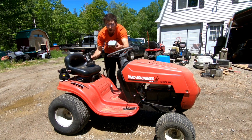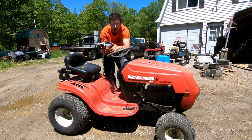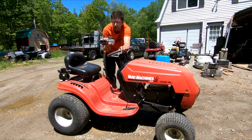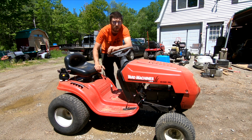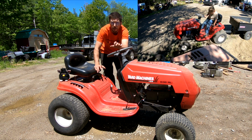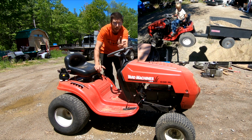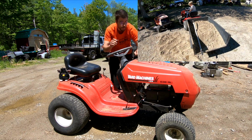And that winch motor we ran off of a regular little 24-volt controller. And I'll include in the description a link for the original video building that. And that worked out pretty good. That setup actually was capable of about 30 minutes worth of drive time. Took about 2 hours to charge the battery, and it would haul along a garden tractor trailer filled quite easily.